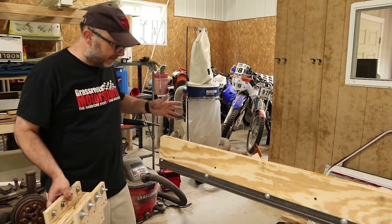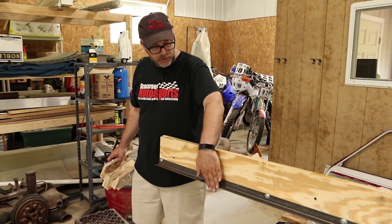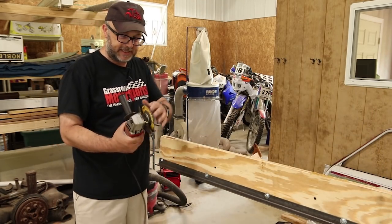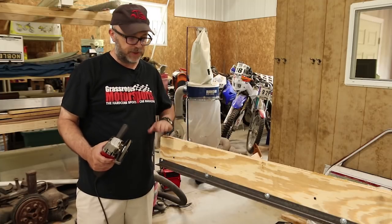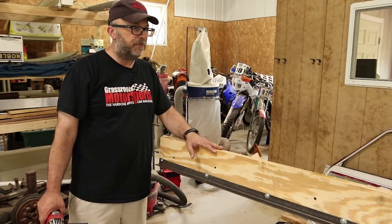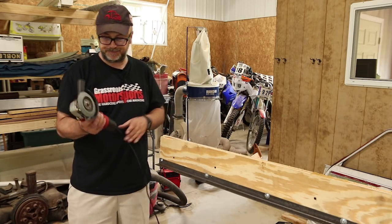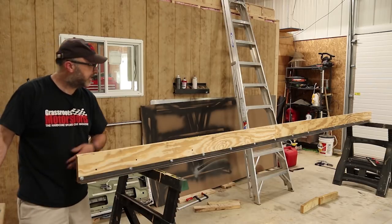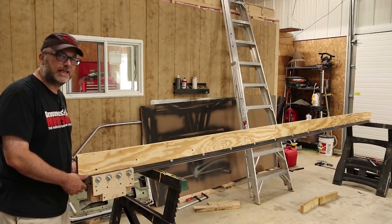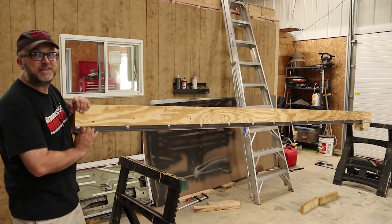This isn't going to see extremely heavy use but I don't plan on ever replacing it either. So I'm going to take my grinder with the abrasive flap disc and polish that edge — that should take off some of the mill scale, make it nice and slick, help with the clearance issues and prevent wear over time. After a quick polish with the grinder — didn't really take much off, just enough to smooth it up — let's do a quick test and see if it rolls all the way to the end on its own. I think that'll work.